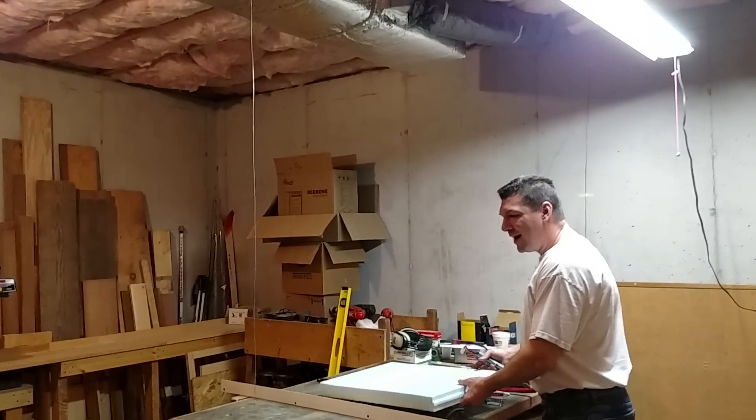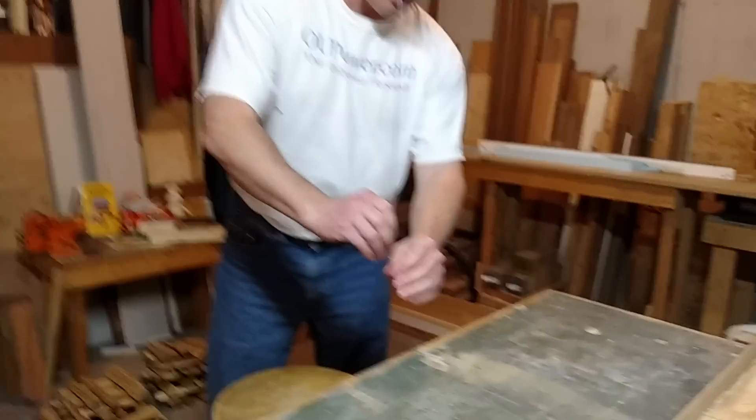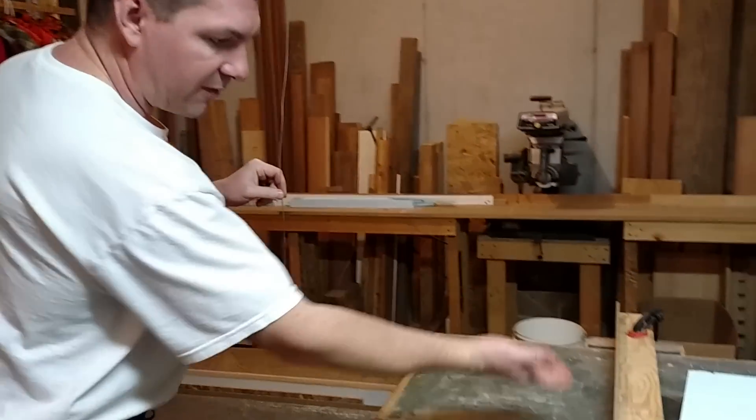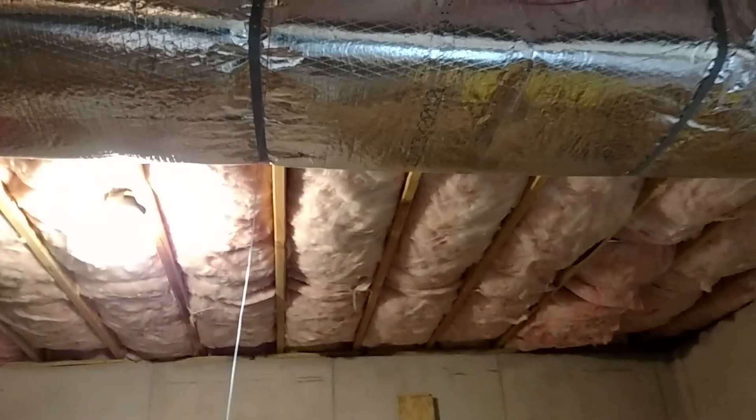I just finished the ultimate hot wire cutting device — that's what I'm naming it. The ultimate hot wire cutting device is better than all of them combined, because I can take this thing, assemble or disassemble it without any problem at all. I can take this wire and put it up out of the way — my table's totally free. There's nothing on here other than a fence, which is temporarily clamped on. There are rubber bands at the top keeping tension on things, and that red wire going all the way around connects down at the bottom to my battery source.